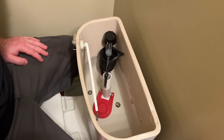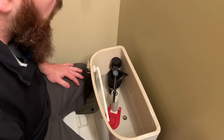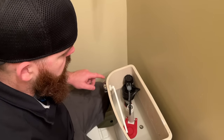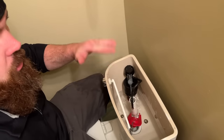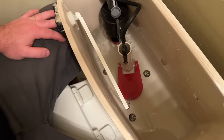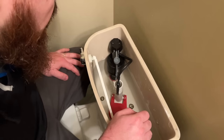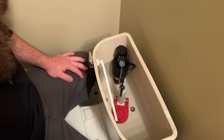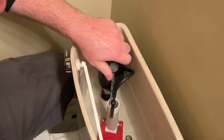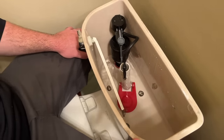The first or second flush may be a one-off, and then the third time you may experience an issue — the flapper may hang up, move around, or shift a little. If it shifts too far one way or the other, it could break the seal. As this fill valve settles in, the water level may rise or fall. After our second flush, we can see it's sitting almost a little off to the left, but that flange on the inside has a good solid inch to seat on. We brought the water level down a smidge — just a few clicks of the screw knob. It usually takes between three to six flushes to dial all this in.